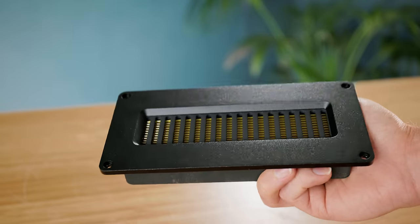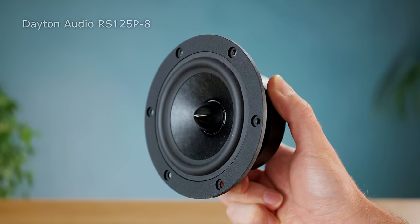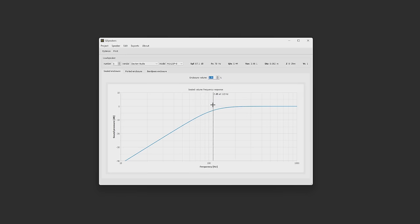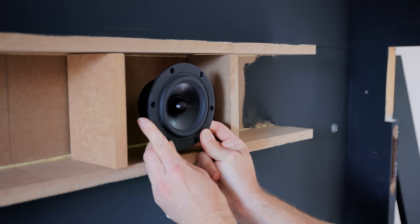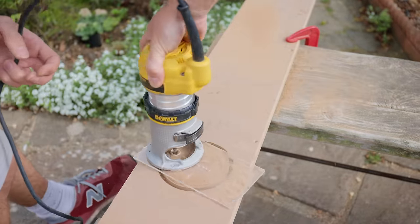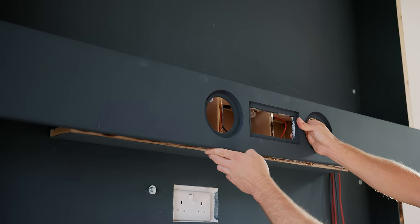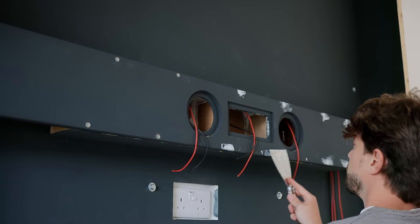Focusing on the drivers for the centre channel, I've got a single Dayton Audio Air Motion Transformer tweeter for high frequency detail, which can be paired with dual Dayton Audio reference drivers for smooth vocals. Using an app like Cue Speakers, we can see that the ideal sealed enclosure volume for these midtone drivers is 2.5 litres, so we can use some dividers to make sure that each one has a chamber of this calculated air volume. Pinning a router in place to some MDF with a screw allows us to use it like a compass to make the required recessed holes for them, although as the AMT tweeter is square, a jigsaw is more suitable. Once painted, it can be glued in place, using some screws as well to ensure a tight fit with no air gaps, with the only caveat being that they need filling afterwards so that they can't be seen.